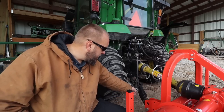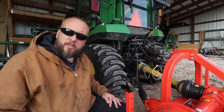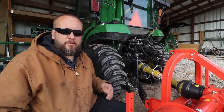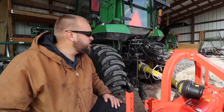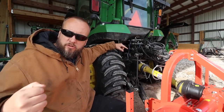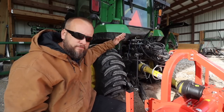I also think they should have telescoping stabilizers. I upgraded to aftermarket telescoping stabilizers, and personally, I had an issue with them. I've detailed that issue already. I switched back to the stock stabilizers. When I bought the machine, I added two sets of rear remotes. That's what the two levers in the operator station are. Those work perfectly.